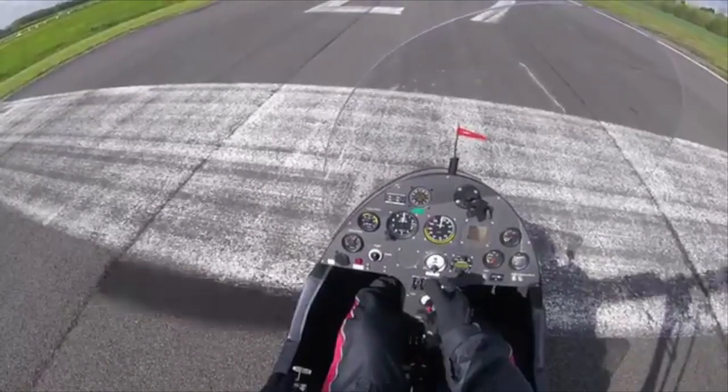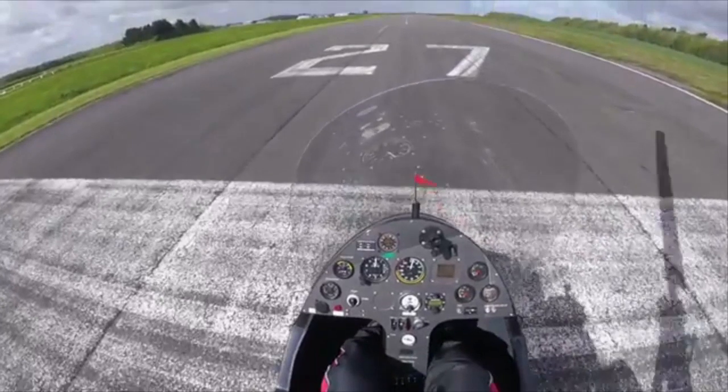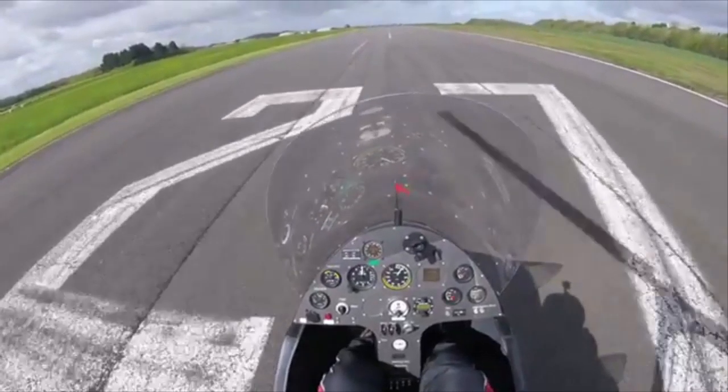So, with pre-rotation to 200 to 220, you're going to consider breaking down the initial process as follows: stick fully back and start the ground roll, and power to get moving and keep accelerating. Notice that's just two steps, because otherwise the risk is to over-complicate and add steps that are either implied or very dependent upon aircraft. For example, the stick is already fully back in a Magni from around 120. So here we could substitute 'stick fully back' for 'release the pre-rotator.' It is implied that we release the wheel brake if we're going to start the ground roll. The point is to declutter, and two steps to remember makes for much more mental capacity for what is to come.